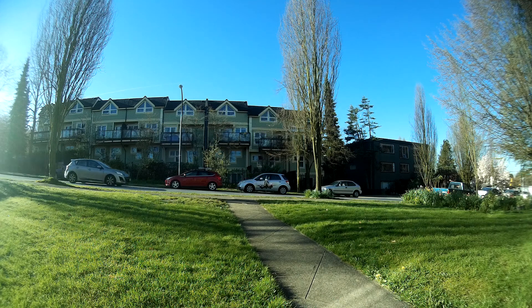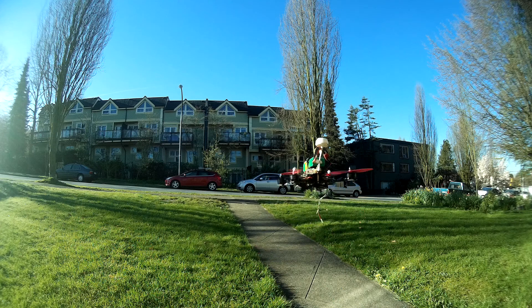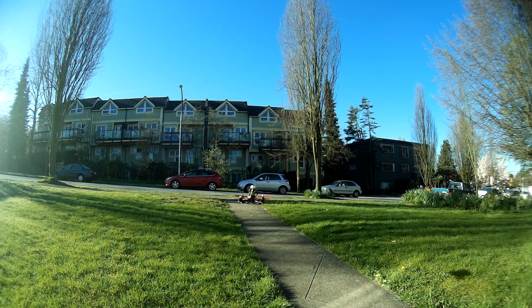Altitude hold on NAZE — I think as well as on the FreeFlight board which the NAZE32 was based on — you have it bouncing around when it's in baro mode altitude hold, because it's trying to compensate for the change in barometric pressure, and on the ground barometric pressure can change quite drastically. I think air mode definitely — I don't know if it includes the baro — it might actually use the baro, and that's why you have that bouncing when it comes down to the ground.